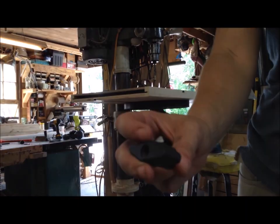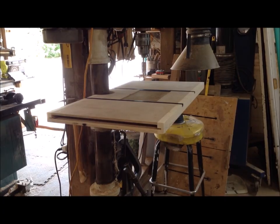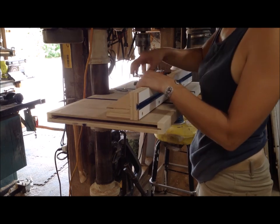After that, I dry-fit everything on top of the table — it was a tight fit. The piece I'm calling the throat sticking out the bottom made getting the knobs to fit tricky; they were a little wide. Once in place, I put the fence on and tested that out. The clearances under here are really tight. I might end up shaving off the edges of the knobs so they don't hit. You can see that if I have them there, I could swap them and slide things around — loosening them gives about a little over an inch of movement.